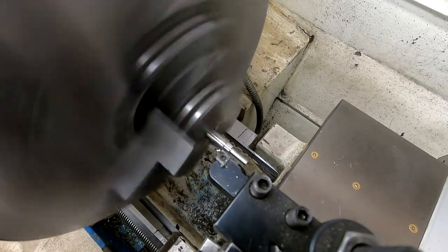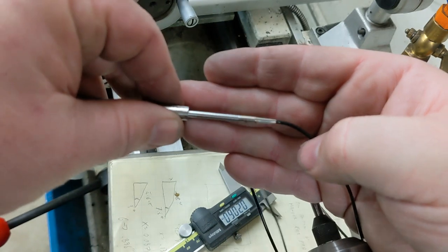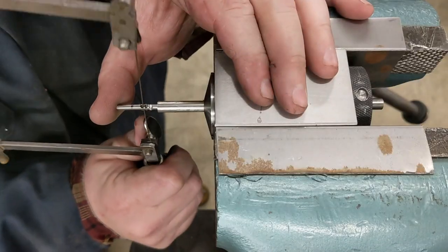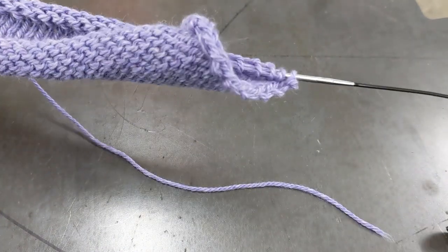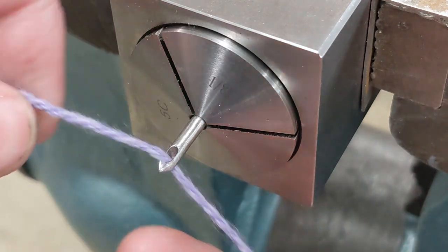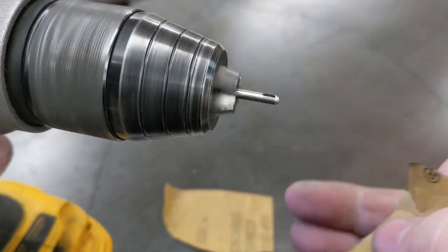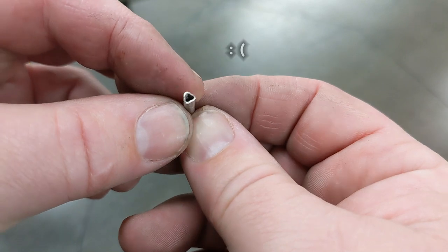Back to the shop. Mark II had several improvements: even narrower, down to an eighth of an inch to match the cable stud, and no more flattened sides, so that transition can't snag when being pulled backwards. Since I had broken my only 2mm end mill, I skipped directly to drilling and then sawing out the slot this time. This was all definitely an improvement when the cable was pulling yarn — very smooth — but still not great when the yarn was pulling the cable. I filed in two grooves into either side of the upper tip so that the yarn can sit in them, hoping it would pull more evenly. And then I thought one last polish would be nice, so I chucked it in the drill. Looked great, until I realized what the drill chuck had done to the threaded end. Double blast.